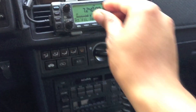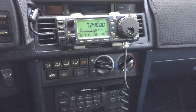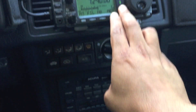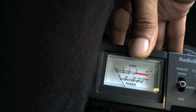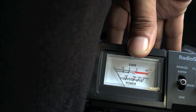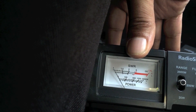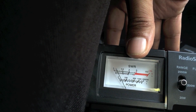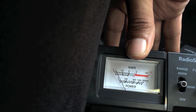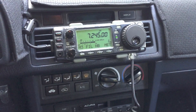Okay, so looks like I'm at 7.240 megahertz, 40-meter band, just at minimal power. I'm going to go ahead and key up. That's my SWR — 2.55. And that's at 7.275. So it's probably a little lower than I'd want. Checking around 7.235, 7.240, 7.245 — yeah, I guess it's probably not worth adjusting further. 7.245 is probably a good position there, and it might improve a little when I actually wire this up properly.